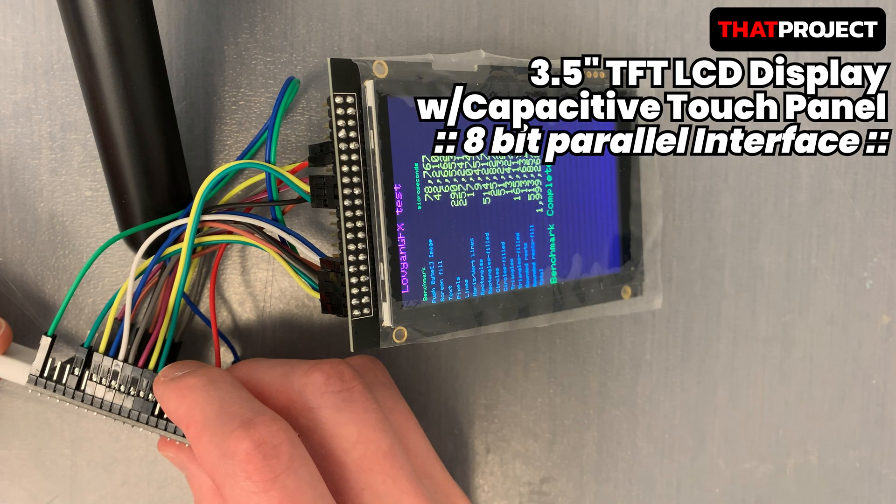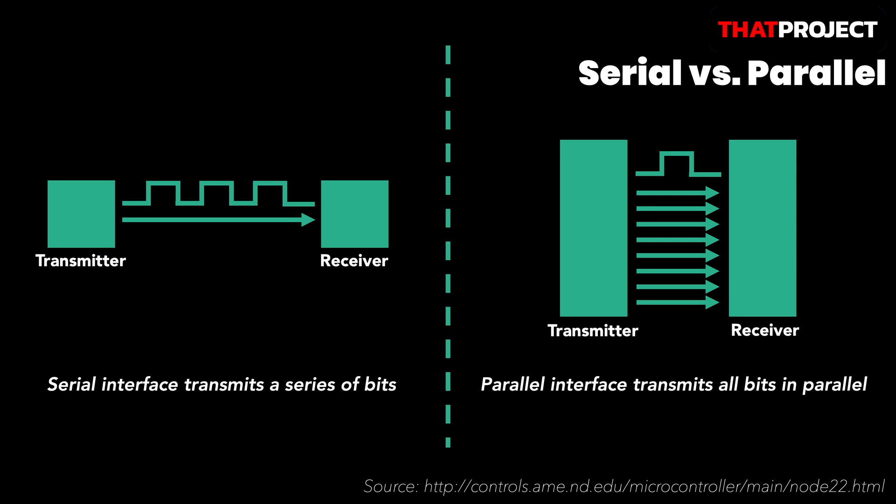Let's take a quick look at the difference between parallel and serial interfaces. We can either transmit a byte in parallel or in serial form. This drawing illustrates the differences between these two communication mechanisms. In serial mode, the bits are transmitted as a series of pulses. In parallel mode, each bit has a single wire devoted to it and all the bits are transmitted at the same time. The advantage of the serial interface is fewer data pins, cheaper cost, and easy setup. The parallel interface offers faster data transmission and higher performance, but the problem is it's more expensive than the serial interface.